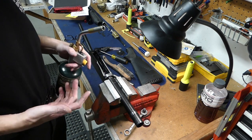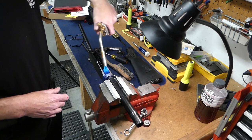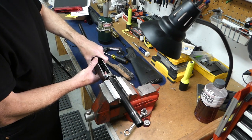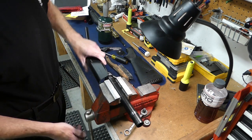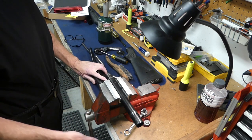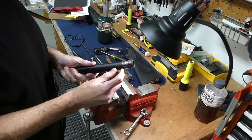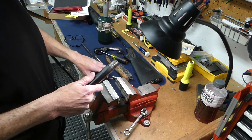Apply heat — this is the trick. You can use a heat gun. Concentrate right in the thread area here to break the bond of whatever level of thread locker you'll find between the receiver and the magazine tube. Then you can grab it by hand and give it a turn, or stick a handy piece of wood in the receiver, give it a little palm or two, and it will break loose. Once it breaks loose, just unscrew the receiver from the magazine tube. The only other thing you might run into is a small adapter that adapts the fine-thread female to a coarser acme-thread male to fit the M2 receiver. Keep your heat in the thread area and in the receiver — it will all come loose.